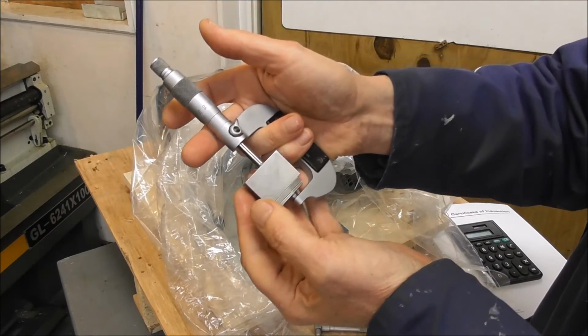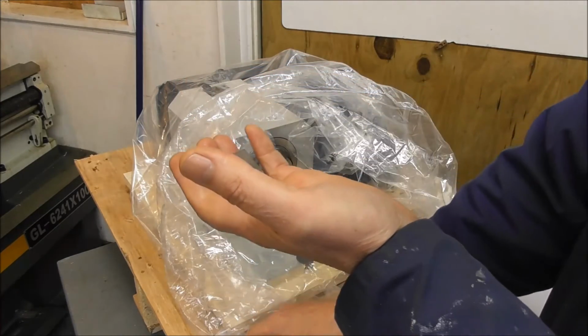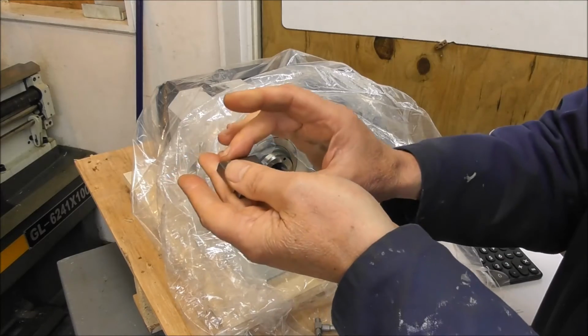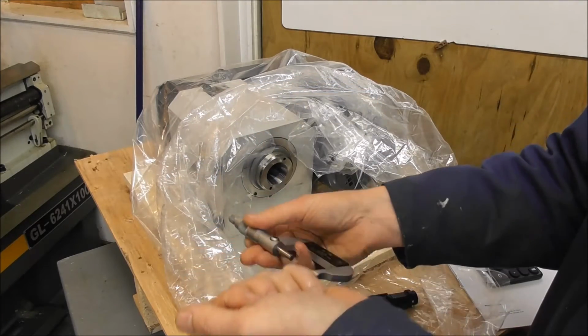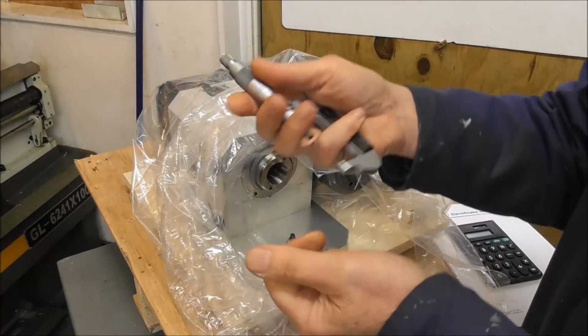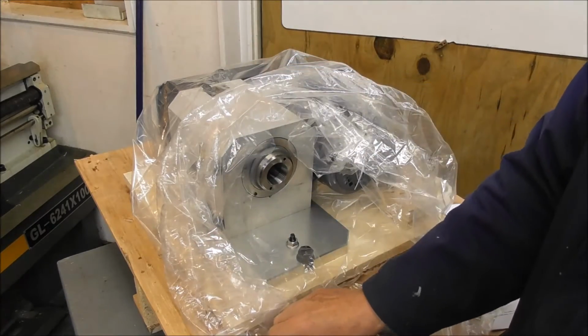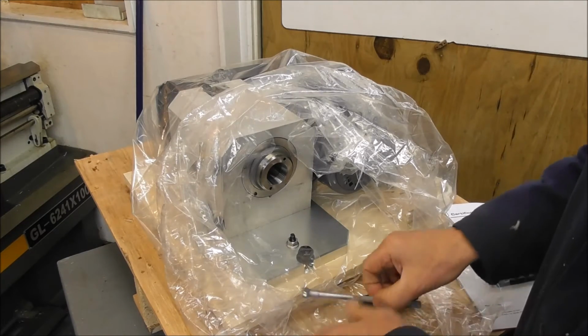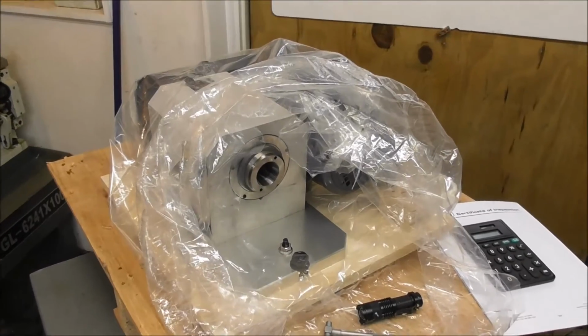So it's increased. That slip gauge stack has increased by 4 microns just in a few minutes of holding it. Just the thermal expansion compared with the mic. If I'd held the mic as well, it probably wouldn't be showing a difference. So that's one of the many things that have to be considered when you're doing precision measuring.